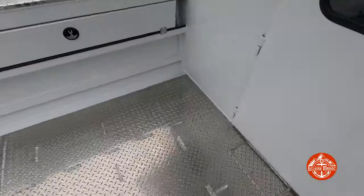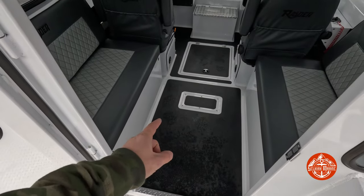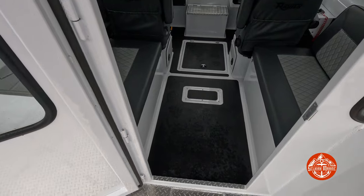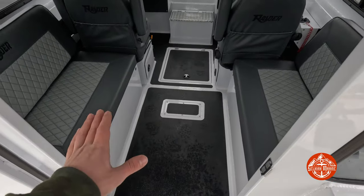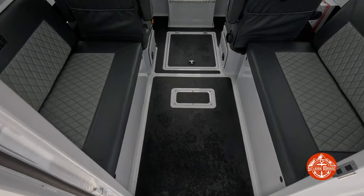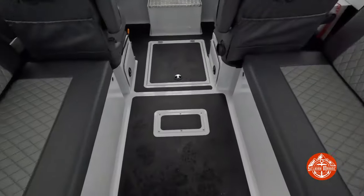Let's hop inside. Here's one of my favorite features of the boat and that's our charter interior package. The first time I saw one of these done I was absolutely floored — it looks so good. What charter interior means is you get 190-plate welded down as the floor, all your seat boxes are welded to it and covered in our KiwiGrip non-skid. Got the 40-inch seat boxes — it's all storage under them, all carpeted.